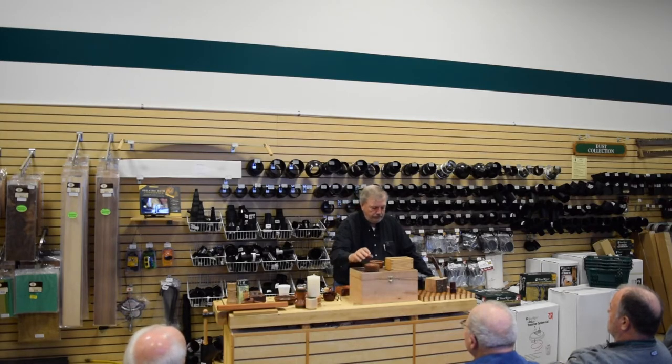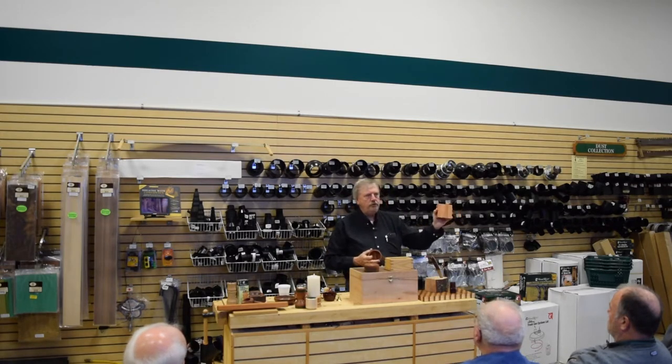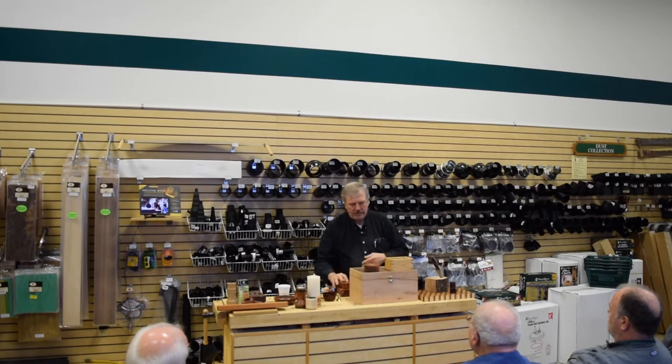But great thing. So when you look at blocks of wood like this, start using your imagination. What piece of wood is actually sitting in here? You can do these nice crazy little lines. You know what those lines are colored with? Wire. I burned them. Turn the lathe up real high, put the wire in there and hold it tight, and it burns that nice little black line. Does a black line fade? No, it's burnt. So it works. Just little decorations.